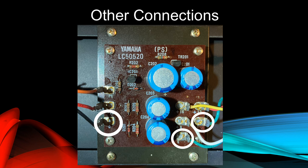They're connected to green wires. The upper green wire is the ground connection for the pre-amplifier circuit and the lower green wire is the ground connection for the tremolo circuit. Direct current flows from the plus 12, plus 16, and plus 8 volt power supply connections to those circuits, then back to the ground connection through the green wires. Each green wire provides a return path for the DC current flowing from the power supply.